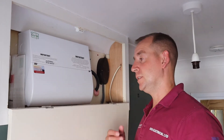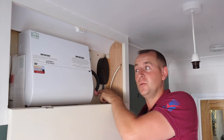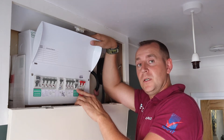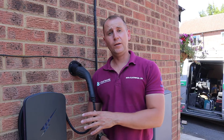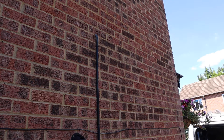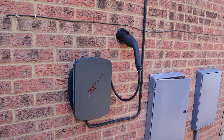We'll do the final run through the job as we normally do. We have the EV ultra cable coming through the wall here — I've used some fire-rated expanding foam to fill that hole up — into the side of the consumer unit via a 25mm stuffing gland. Inside the consumer unit I've replaced the RCD for a type A double pole RCD, and along here we have the vehicle charger breaker. Here we have the Hypervolt installed. The cable comes through the wall at high level without blowing the brickwork, siliconed up, runs down supported with union clips, and into the bottom of the Hypervolt.